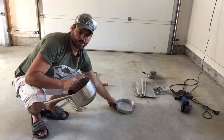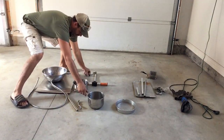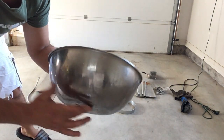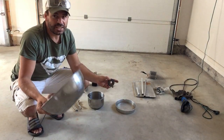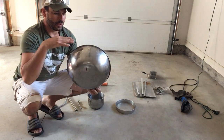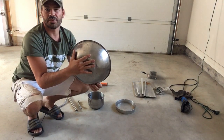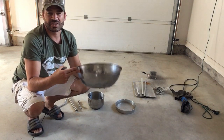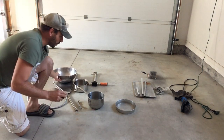Something I want to point out is the magnetic test. Sometimes you have items like this mixing bowl and this barbecue top that look like stainless steel — they have that metallic look — but if you put a magnet to it, it sticks. Both aluminum and good stainless steel are not magnetic. When something that looks like stainless steel is magnetic, it's because there's only a small coating of nickel. At a scrapyard, that will be classified at the regular steel price, because there's not enough nickel to deem it as stainless steel.